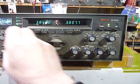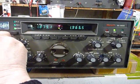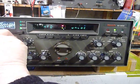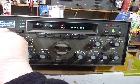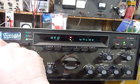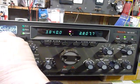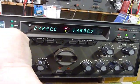It works on all bands — all the HF bands. Now I see the HFO unlocked — that's because I have it in between two positions on the band switch. When you do that, the high frequency oscillator unlocks and it shows you that; it's part of the error messages. So it has 160, 80, 40, 20, all the way on up to 10 meters.